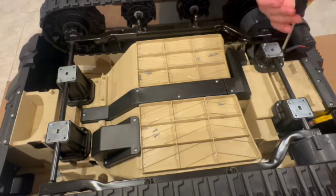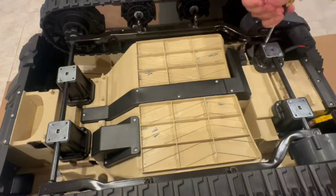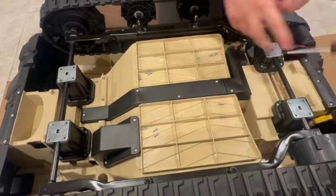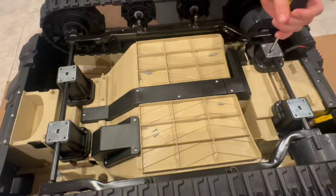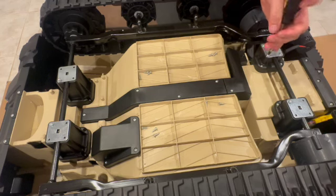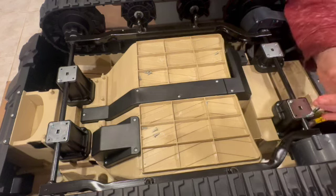The most important thing, you put in the first screw, and don't over tighten these screws. It'll strip out pretty easily, so tighten nice and slow, tighten up those two screws first. Now we can tighten up the other two. Now if one of these screws does strip out, three screws will hold this pretty adequately, so don't worry if you strip one screw out. And perfect. Put all those screws in.